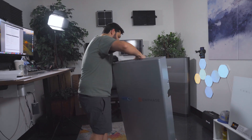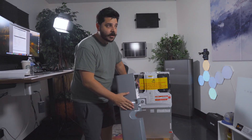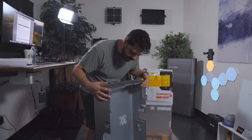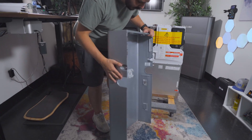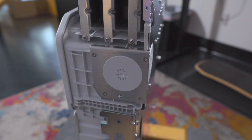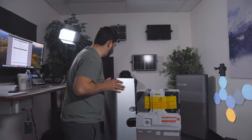I'm going to go ahead and remove it — it's pretty straightforward to unclip. What's really nice that Enphase changed from the previous generation is now you can put conduit on both sides. You can see these little cutouts in the cover, and that allows us to enter one side of the battery, wire it up, and come out the other side to connect multiple units together to back up your home or use for self-consumption, tied to your Enphase combiner box.